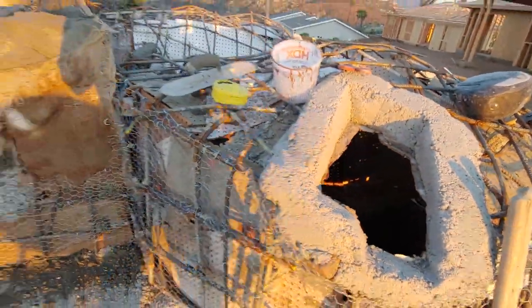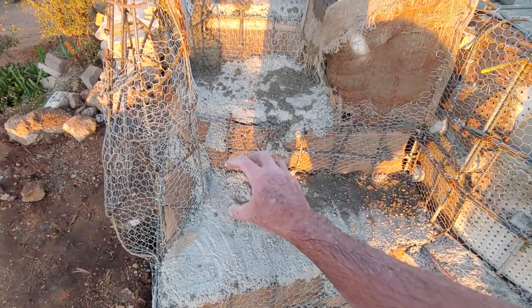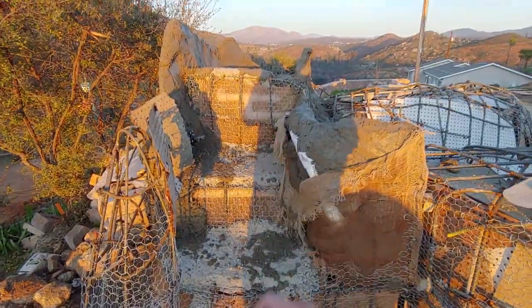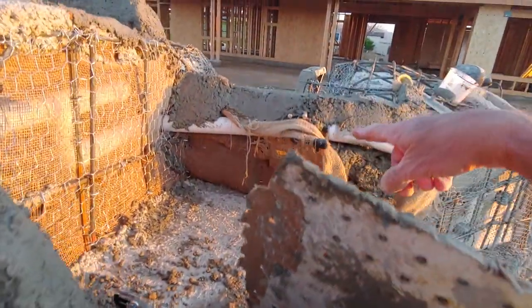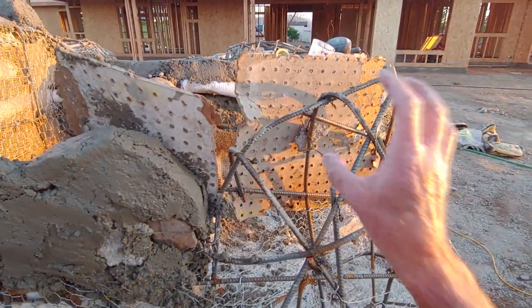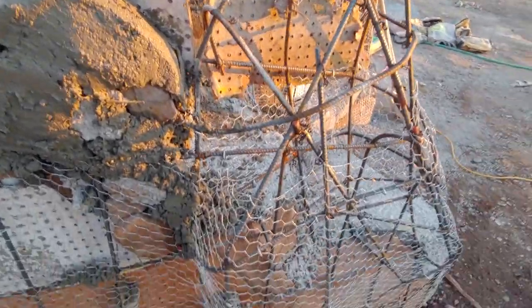If there's any little spots we can fill those in with burlap. That's the inside of the grotto. We pre-poured these sort of bench steps. I'm going to put a little bench in the corner - like a stone or whatever - maybe one on the right side and then left so you can get up to the top of the slide. Our pipe's already set in there. We're pre-setting that with our Jandy three-way valves, one there and one here. Pegboard - you can just throw this stuff in and it does a great job of serving as a backstop for your mud.